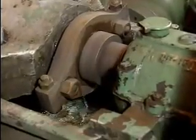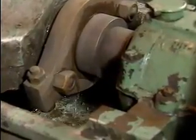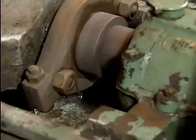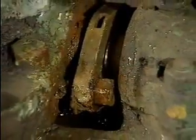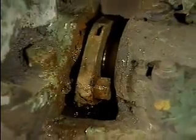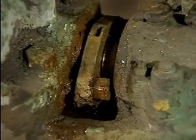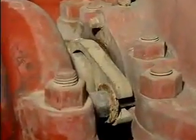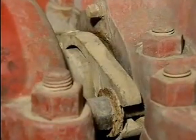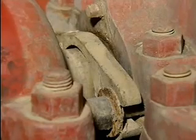Another visible symptom on an operating pump is too much or too little leakage from the stuffing box. This leakage is referred to as leak-off. Too much leak-off can mean that the gland follower needs tightening. If that doesn't solve the problem, then the packing is probably worn and must be replaced. Too little leak-off indicates that the gland follower is too tight, or that the gland sealing line or the lantern ring is blocked and must be cleaned out.